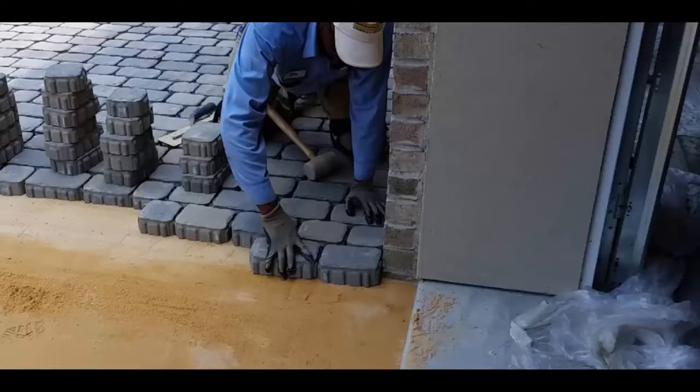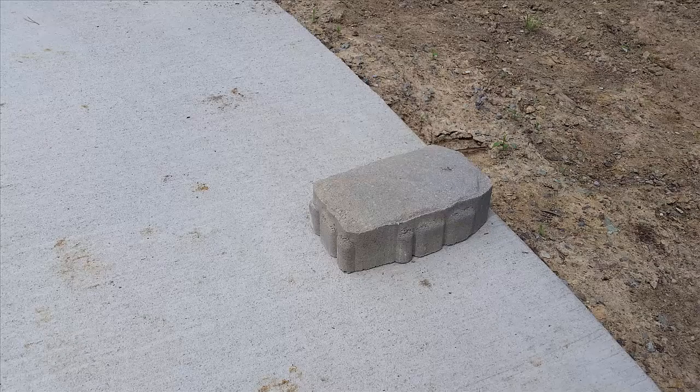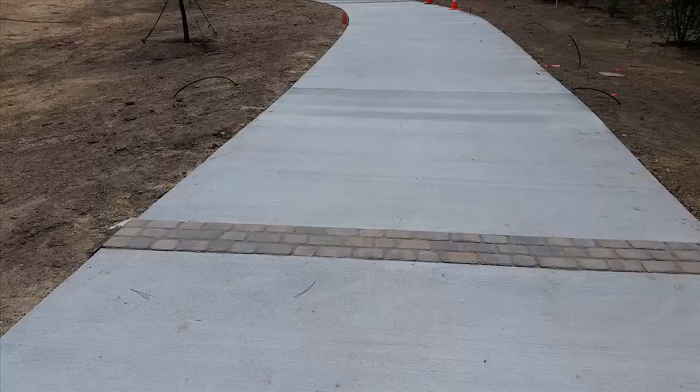In this installation, the contractor is anticipating a bit of settlement as the pavers go through the years. To counteract that, he has chosen to set the pavers just a bit higher than the level of the garage slab. Often a border is set along the edges to help contain any small pieces that result from cutting the pavers at the edges to fit the pattern. Those borders also enhance the look of the overall installation.